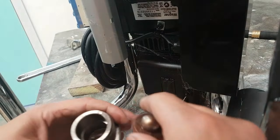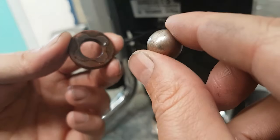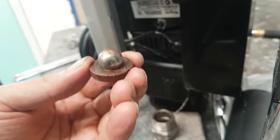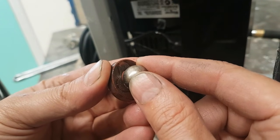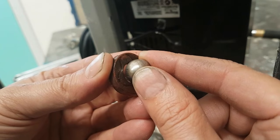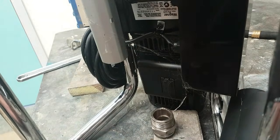The whole purpose of all of this was to show you — I need this seat and this ball to be cleaned, so that when they do sit against each other there is a tight, clean seal all the way around. If there is even the smallest bit of anything protruding or sitting there, we won't get that tight seal, and therefore it's not going to create vacuum. It's just going to keep releasing back down as it's sucking up.